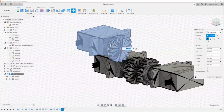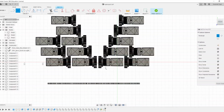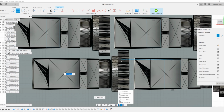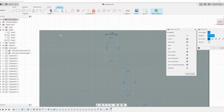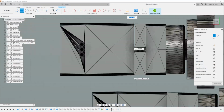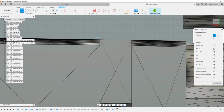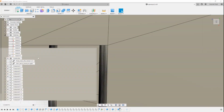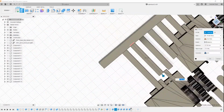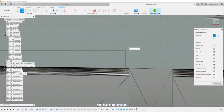Once I had this 3-dimensional Kalimba designed in virtual space, I could position all my servos where they needed to be relative to each other so that they fit properly and didn't interfere with one another. Once those are all properly positioned, then I could design a frame to fit around it. So you can see here that I designed a base plate with a bunch of arms sticking out to meet each servo at their proper position. And there's a little bit of a gap because I was going to hot glue these, so I was accounting for the space of the hot glue as well.